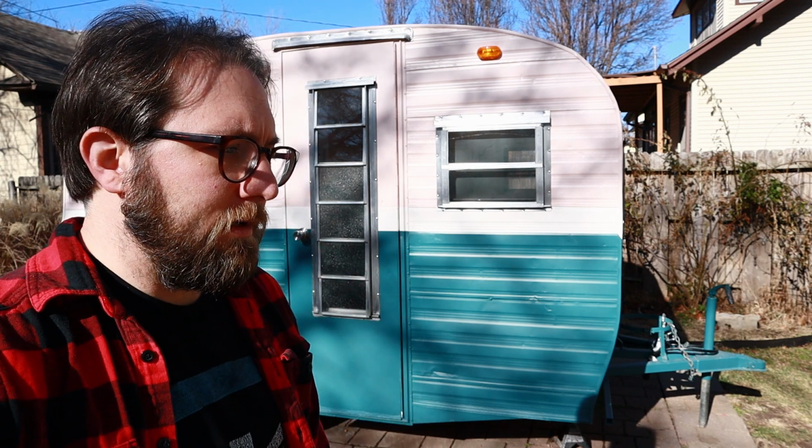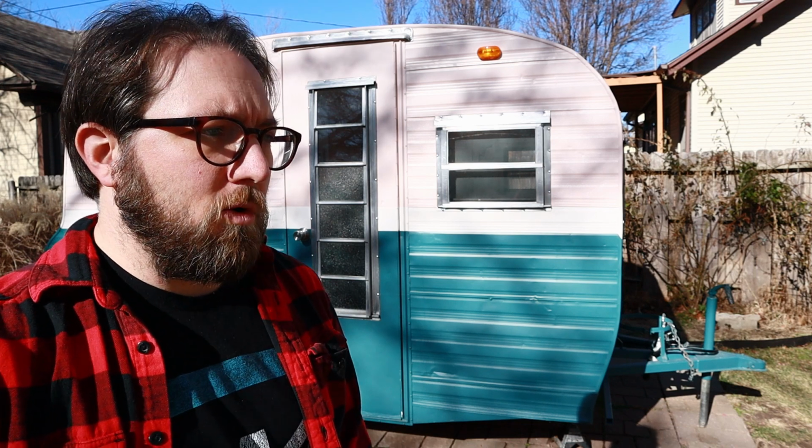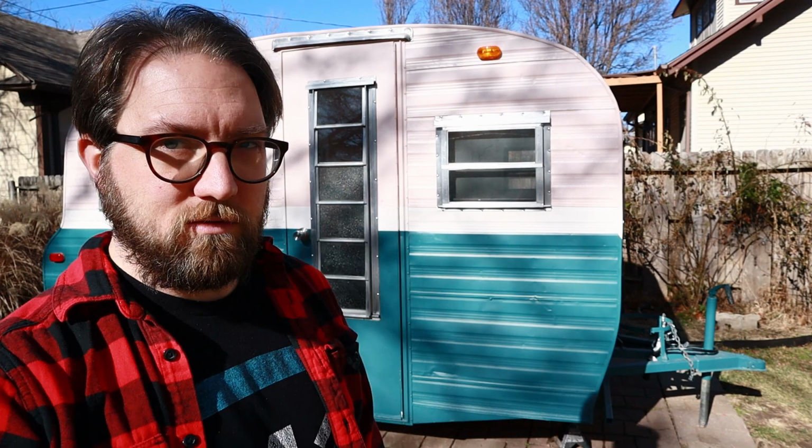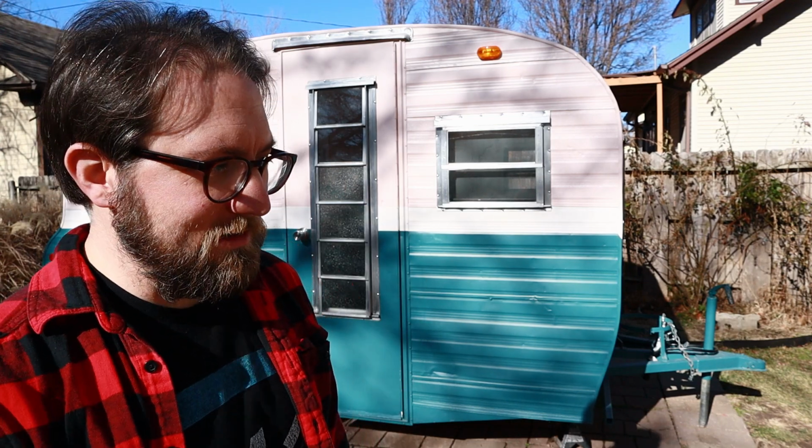One other thing that we've kind of changed about it, we didn't really like the faucet that they were using, so Catherine found one that she liked the look of, but it only came in a hot and cold variety, and it's a little more work to use one of those, because you can't just leave your hot inlet open, because if you turn the little adjuster to it, you'll just run your cold water back out of it and into your cabinet. So we have to use a little T-fitting to connect those two together. Pretty simple. I think it will work.